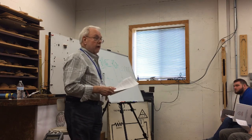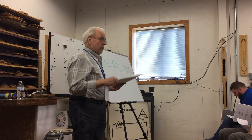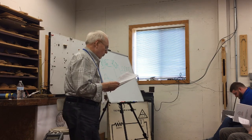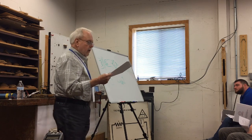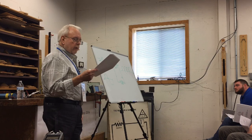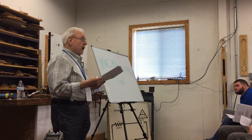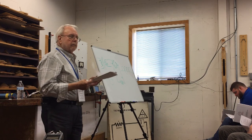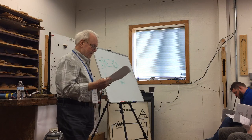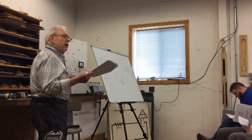Well, I'm afraid it's the ice maker again. Diodes don't follow Ohm's law. Great as it is, they don't pay any attention. Pretty much no matter how much current a diode carries, you lose about 1/2 volt going through it. That's why they're called semiconductors, because they don't behave properly. They're weird but useful, kind of like most of us. We'll break in just a minute.